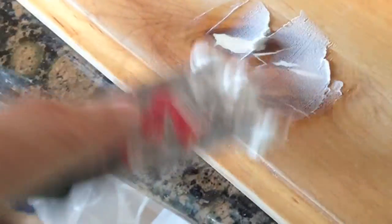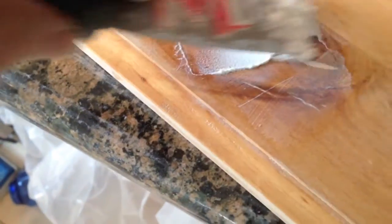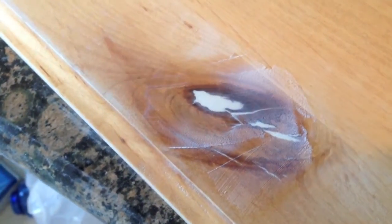I already did this and I've sanded it down. But since I'm doing kitchen cabinets, I want to make sure that it's covered really well, so I just put up a little bit with my putty knife. I want to scrape most of it off, but just leave just enough so that when you come back and sand, there's not a depression.